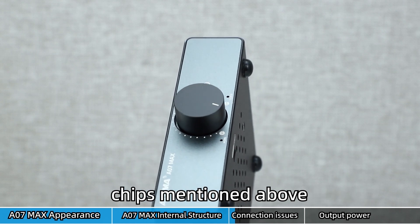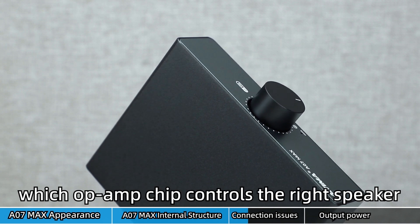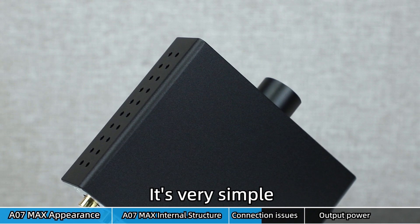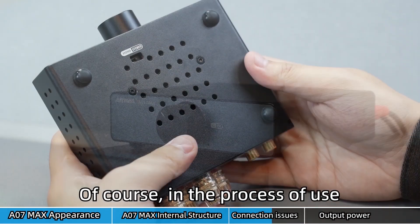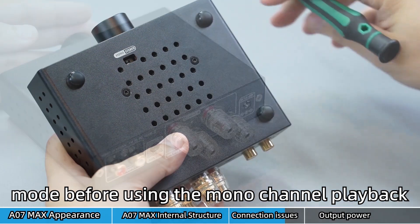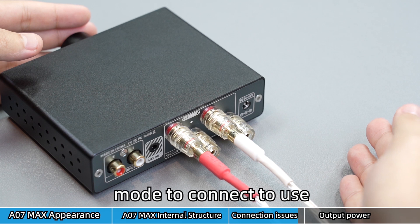Regarding the interchangeable op-amp chips, I need to address a question a customer asked earlier: if running two amplifiers in mono mode, which op-amp chip controls the right speaker output and which controls the left speaker output, or do I need to swap all two? It's very simple — just swap U7 in mono mode, and swap both in dual-channel mode. There are still details to pay attention to: we need to switch to mono mode before using mono-channel playback, and the correct connection is very important, so we need to correspond to the correct mode when connecting.